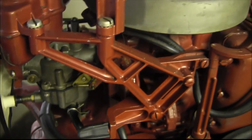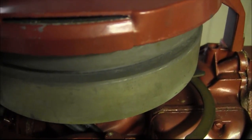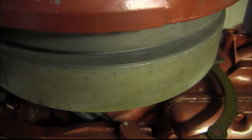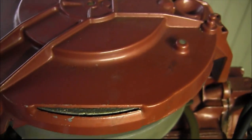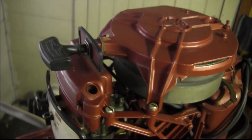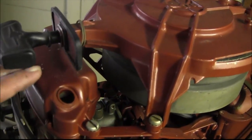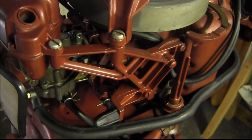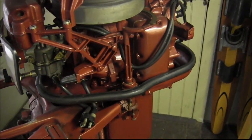This is a 10 horsepower power head, and it's magneto driven. It has 2 coils, and this obviously is the flywheel, and above we have just the recoil. And we'll get back a little bit so you can see. The piece below the recoil starter here is an air silencer. Not a filter, just a silencer. Because the beauty of these motors is running on the lake.